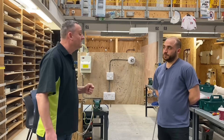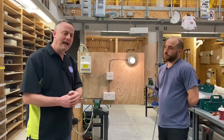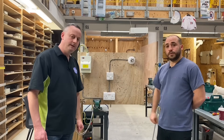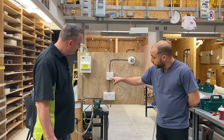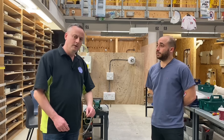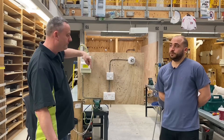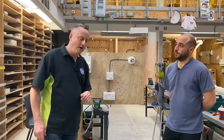Let's say this light is outside — a garage fitting — and it requires maintenance. It's clearly working now, but let's say we need to replace or maintain it. You could isolate the light from the switch here — switch it off and the light goes off. To isolate it securely, undo this screw, the insert comes out, pop out the fuse, and use a little padlock to lock it off safely. That means every socket in the installation can be left on.